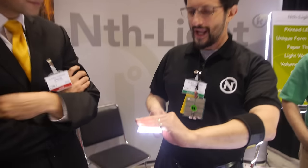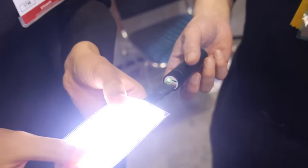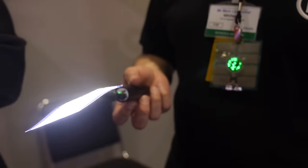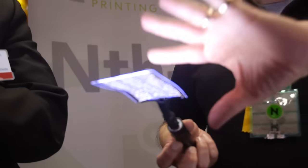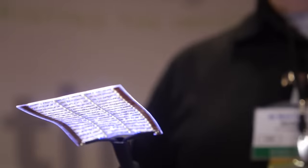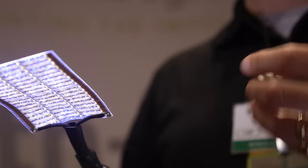It's much more pleasing and it's cooler. You can put your hand on it and it sits pleasantly warm, but that's about it. If you put your hand on a traditional LED, you'll burn your hand. And as you notice, there's no heat sink on that — because we spread the LED over the entire surface, so the entire lighting surface becomes the heat sink, as opposed to a traditional LED where you have to put a Coke-can-sized heat sink on a point LED source.